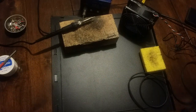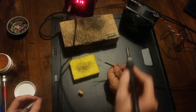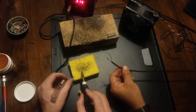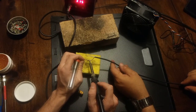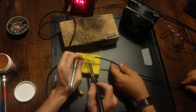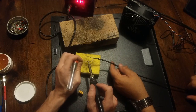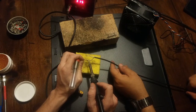Multi-conductor wires are much more flexible along their length; we need to mitigate that on the end and give ourselves a better surface for soldering — that's the point of tinning. When tinning wires you need to get a pretty healthy amount of solder on the wire, especially because we're going into solder pots, which is basically just a pot full of solder that you stick a wire into. But not so much as to cause too much wicking upstream of the solder connection, because that causes brittleness, and brittleness causes fractures.